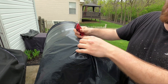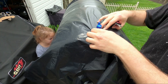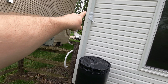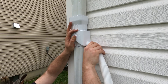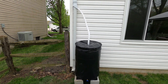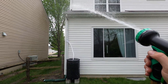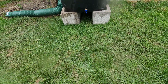With the trash bag mostly wrapped I'm going to cut the hole for the downspout. After you've wrapped the barrel like a Christmas present with the black trash bag, this is pretty much done. The fittings have been installed and siliconed, the diverter has been installed, and the last step is just connecting the bilge hose onto your rain barrel. Now I'm going to give it a test by shooting some water up on the roof to see if we get water coming out the bottom — and there it goes, coming out the bottom.